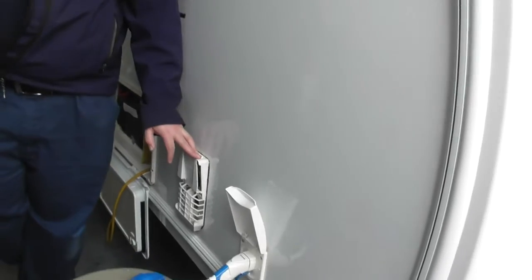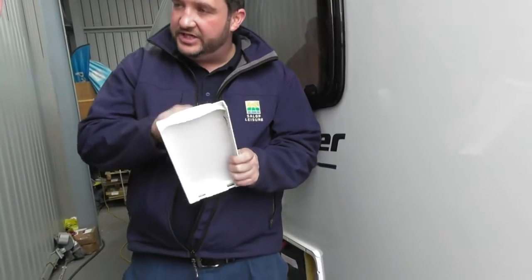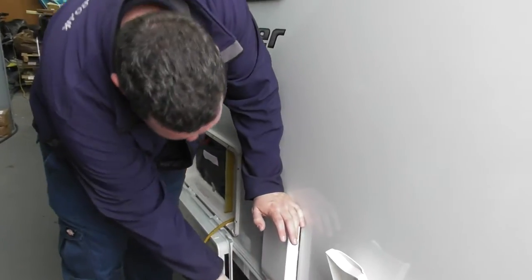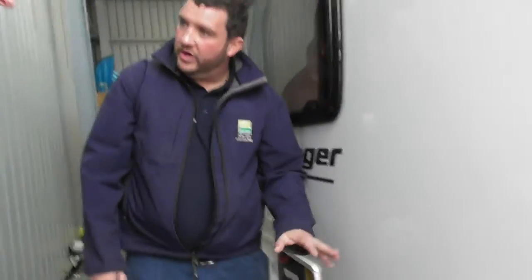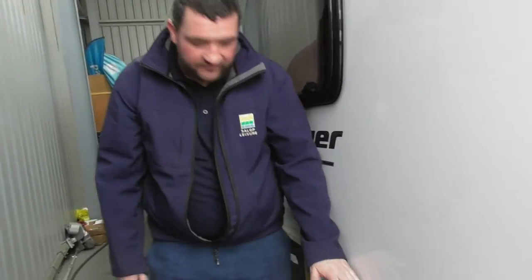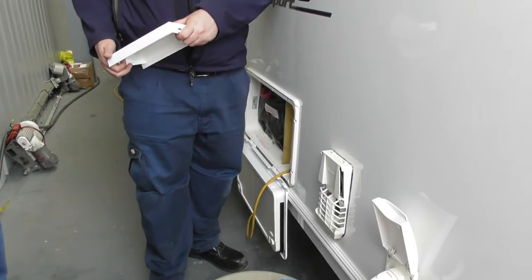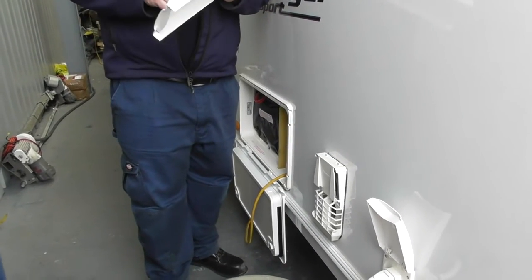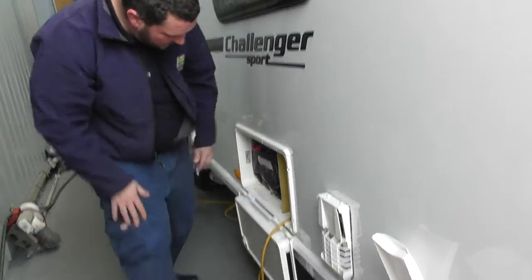Next one down — this is the vent for your hot water boiler. Your hot water boiler will run on gas, electric, or gas and electric at the same time. Anything to do with gas, you need to remove this cover. If you don't need it, just pop it on the top. Anything with gas — cover off; anything with just electric — it's perfectly fine to leave it on. To remove it, just push it down and gently pull it out from the bottom. If you're ever lighting it on gas and you're getting the red light inside, nine out of ten times it's because you've left the cover on.